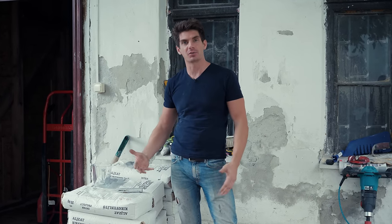Twenty-four hours later the floor has dried and it's got a lovely finish — almost a rubberized coating, dust-free and easy to keep clean. It's unusual to leave self-levelling as a finished floor in a home, but for our workshop purposes it's absolutely great. One thing I'd do differently for a true finished floor: I rolled slightly late on one area, the mix had thickened, and the spiked roller left raised dots. If you're tiling or laying a finished floor on top, no problem at all — but something to be aware of.